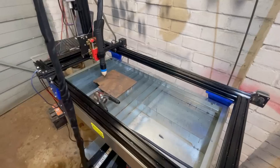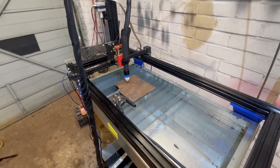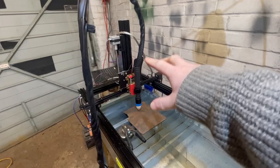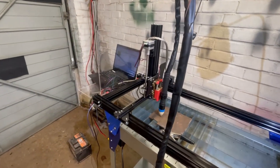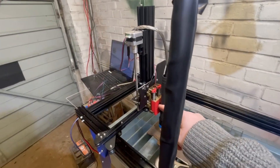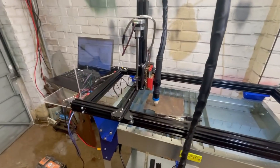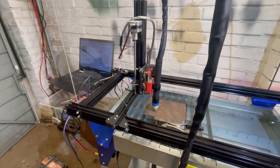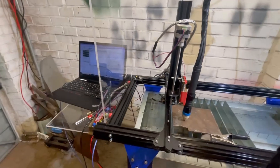Sitrep: just doing a test run. I've got a bit of five mil steel in there. I've started shielding some of the cables, haven't completely done all the routing yet. I've added limit switches to the homing so it can home, although I've put the limit switch on the floating head which isn't ideal - it probably shouldn't be on the floating head. Still thinking about that.